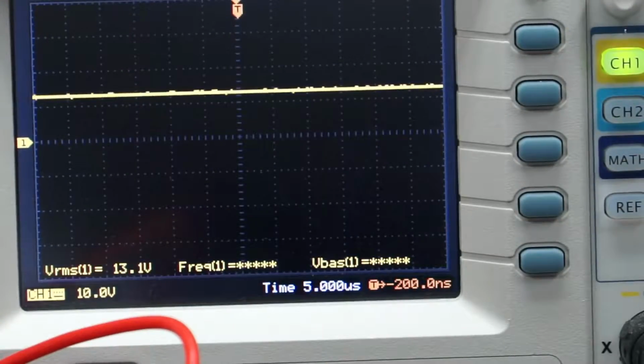So instead of it being the 18 volts of the charger, what you have here is the 13 volts that is what the machine actually runs on. This machine actually runs on 12.6, not 13. It's probably making 13 because it's been pissed on. But before, when I first measured this in the beginning of the video, it had zero, and it had no green light. So we've made some progress here. This board works more now than it did before.